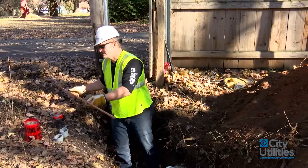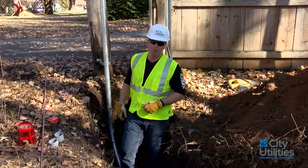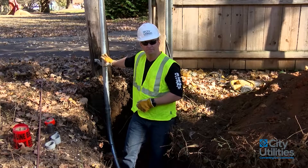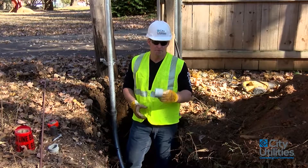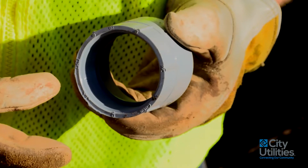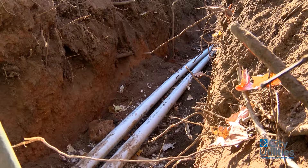Whenever you contact the inspector, he will show up with that and a couple of these lag bolts and go over some of the installation procedures with you. We've already allowed him to attach to our pole, and what is underground is a 24-inch steel galvanized sweep attached to our 10-foot section right here. On the end of that 24-inch radius galvanized sweep is a 24-inch PVC radius. In between is this coupling right here, which screws onto the end of the 24-inch radius galvanized steel, and this end is primered and glued to the 24-inch radius PVC.